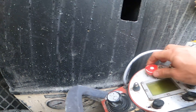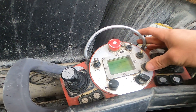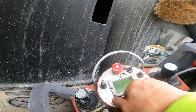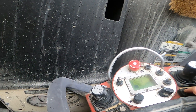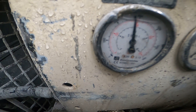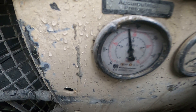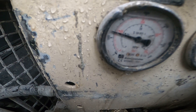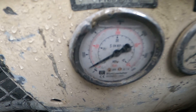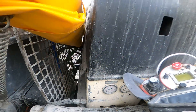One more time, I'm going to reboot the remote just to confirm this. Let this link up. I'm going to turn my RPMs up a little bit higher. You can see that accumulator building pressure, building back up. Okay, now I'm going to hit the e-stop button again. Once again, yeah, we're right about 55 to 60 bar — about the halfway point. We want to be falling between 80 and 110 bar ideally, so we're going to have to charge this thing up.